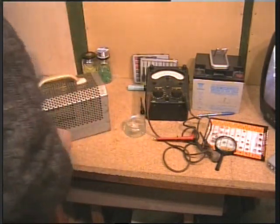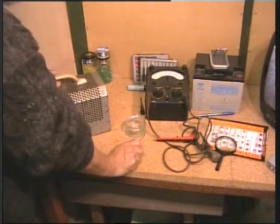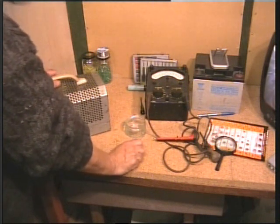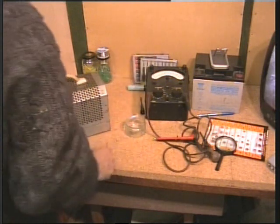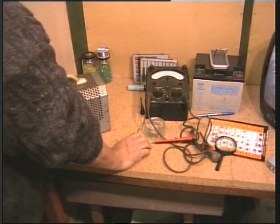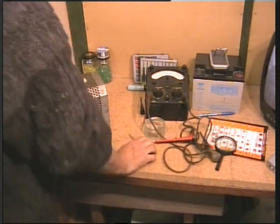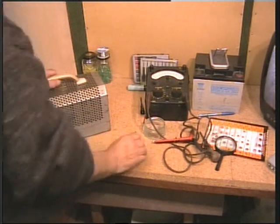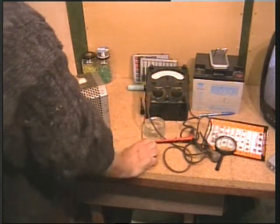Anyway, she put the key in the ignition, turned the key, and it went click, click, click. I thought, oh, that sounds like the starter motor is not engaging the engine. So I lifted up the bonnet, the hood as you call them in the States, and I said, put your lights on. The headlights come on, they were dim, just broad daylight, but they were just dim glimmers, you know.